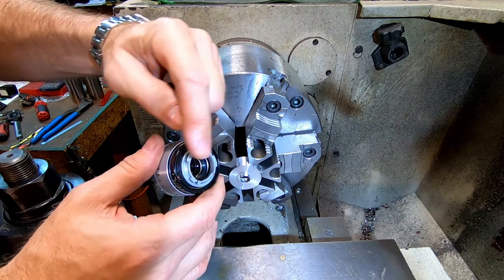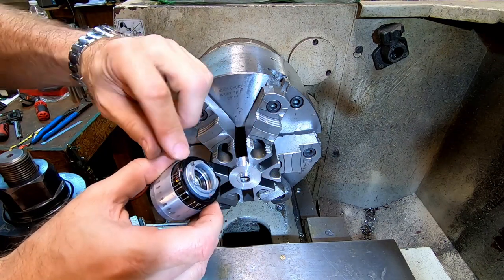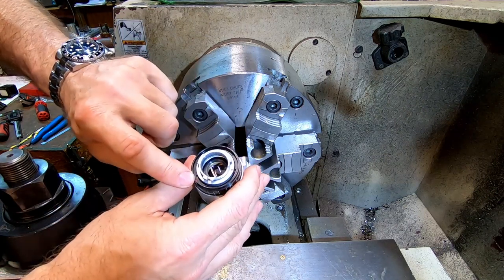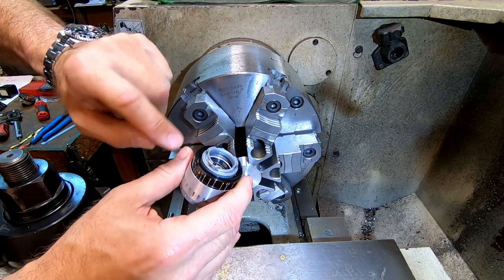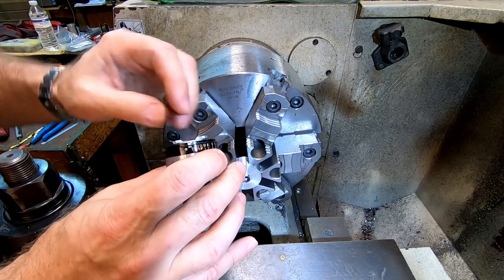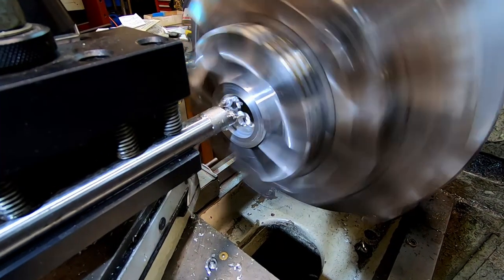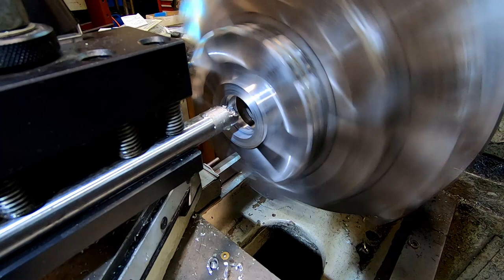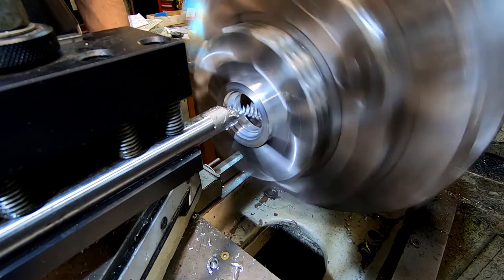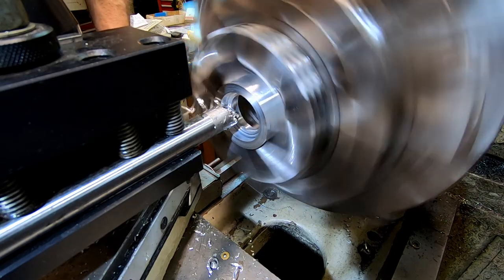I'm going to cut the counterbore - it'll come up past the bayonet over the flange area to try and kill some of the light leak on this side of the mount. There's this notch where the alignment dot is for when you put the lens on the camera, and I'm hoping this covers it enough that it won't be an issue. As you can see it rotates through the range of the bayonet where there's a big opening, but hopefully there's enough turns in the light path that we won't have a problem. I'm cutting this by hand - not power feeding because it's not going that deep.